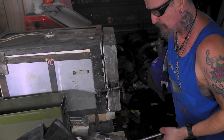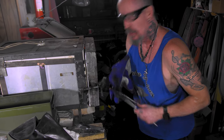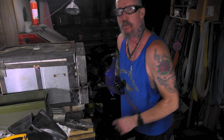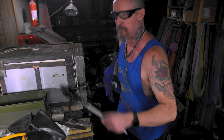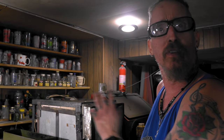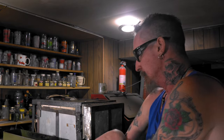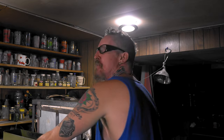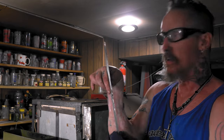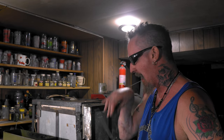All right. One down, one to go. I'll be back at 52-100. I'm gonna do the next one for Instagram. I got my slower quench. I think it's Parks AAA or something like that. It's just a slower quench for 52-100. No anti-scale, nothing. I guess we'll just put the Dexter knife in there first. It's the longest one, thinnest one. See what we get.